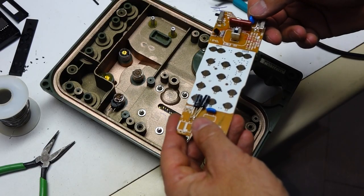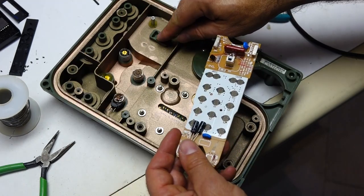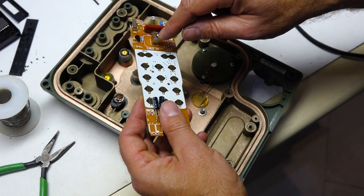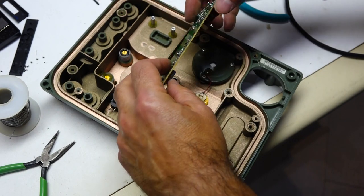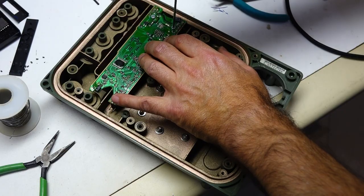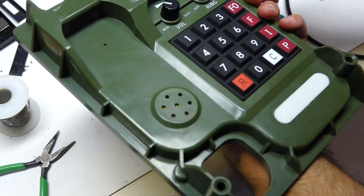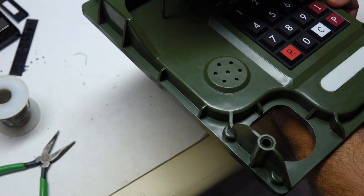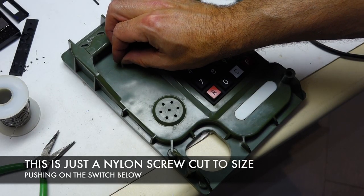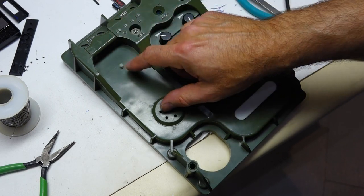The solution I arrived at: I'll place the board over here. I removed the sensor and just drilled a little hole right where the hook switch is. I had to move some capacitors from one side of the board to the other because they were interfering. But now here is the off-hook switch — I intend to put a screw and epoxy it to the end of the cradle.